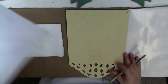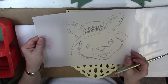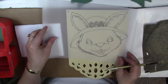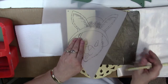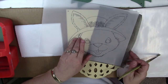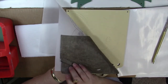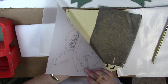To do that, in case you aren't familiar with some basics: I've put the tracing onto a piece of tracing paper using a Sharpie fine point pen so you can kind of see through it. Then with some gray graphite paper, I position the tracing where I want it on the board and slide the transfer paper underneath it, being sure that you have the side that transfers facing down. Then using a fine point stylus, I just go over the lines just lightly. You want enough pressure that your lines come through, but you don't want to press so hard that you cause indentions in your wood or transfer the lines too darkly.